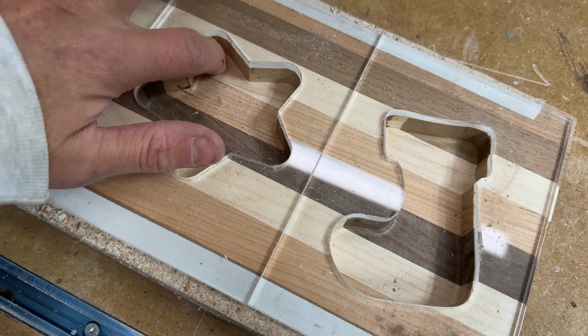And with the inside done, I cut the tray to its final size. I also added a bevel to the sides using my table router before sanding it down to 220 grit, making sure to water pop the final layer. The final step was using food safe oil. My favorite is walrus oil, but let me know in the comments below, which one do you prefer?